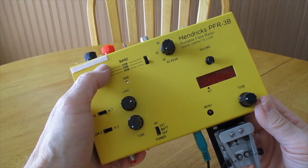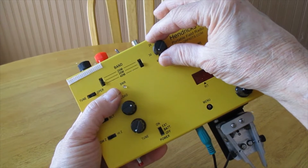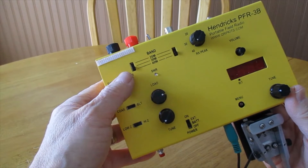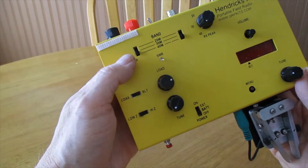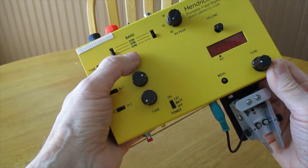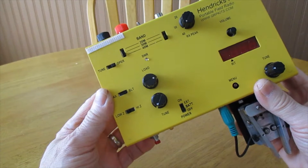Looking at the controls, we have a choice of three bands: 40, 30, and 20, which are the bands most people want when working portable. There's a pre-tuner that you peak for the strongest signal or loudest noise — kind of like a pre-selector on an old Drake 2B. There's a tune/operate switch; in tune position you're protected against high SWR. You connect your antenna, then tune the tune and load controls to minimize the brightness of the SWR LED. If it goes out completely, you're at 1:1. A little brightness means under 2:1; bright means over 2:1.